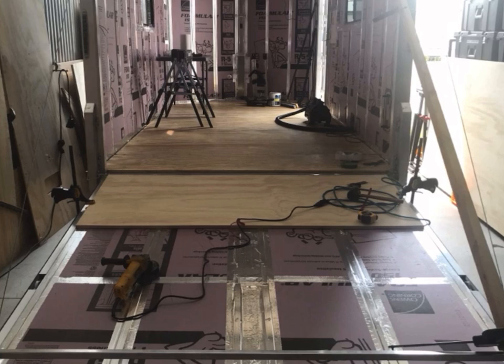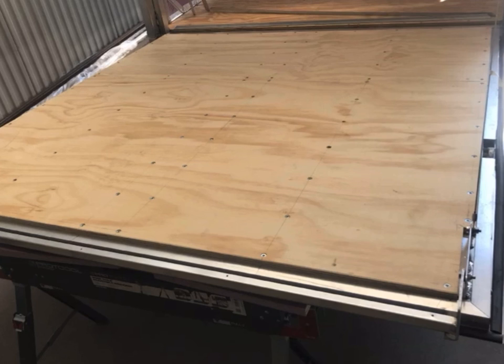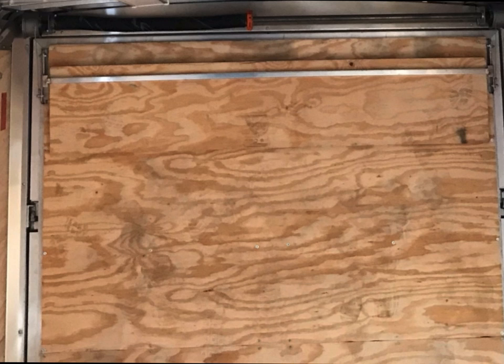I did replace the plywood that came on it with a little heavier material, and I made a longer flip ramp at the bottom because I will be driving a motorcycle on it. I used about three times more screws than what came on it — stainless steel number 12 screws — and I marked, measured, pre-drilled, and counter-sunk all the screw holes. That's what it looks like with the new plywood on it. The door is a little heavier so I actually had to adjust the garage door spring.